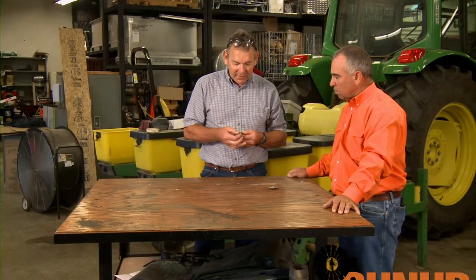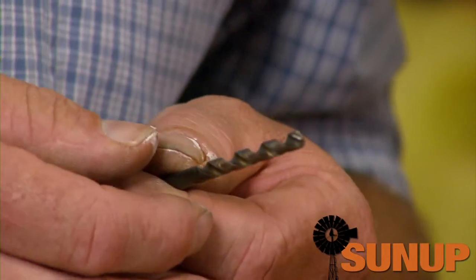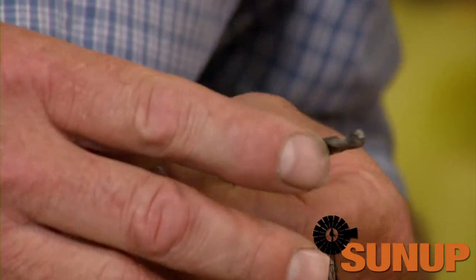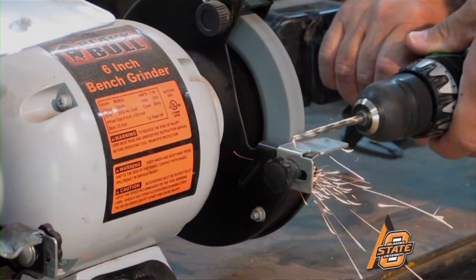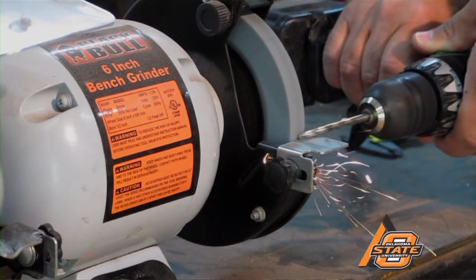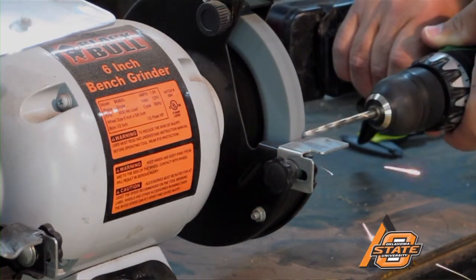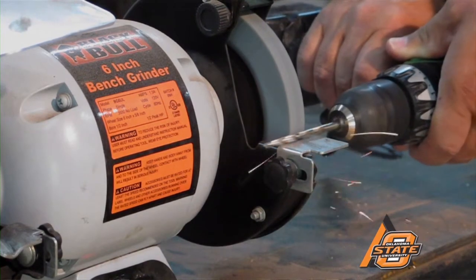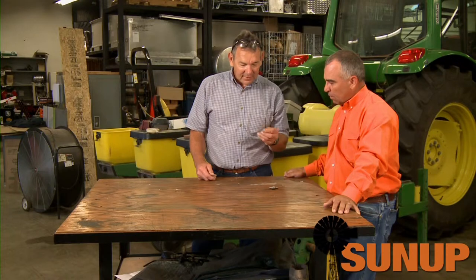You can take a drill bit and put it in your drill, and pick the drill bit that is the size of the outer diameter of your peg at the biggest point, and then taper it on your grinder. The thing that I would do is, once you determine what your diameters need to be on your taper, by putting it in your drill and spinning it, you allow yourself to keep the bit centered, and you're grinding it uniformly all the way around. So that's how we taper one.